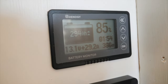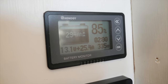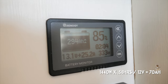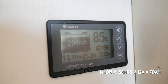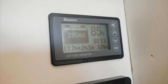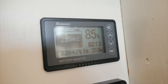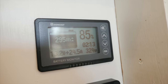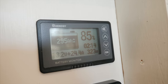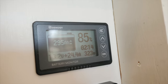The total elapsed time for the four-gallon Bosch hot water heater to fully heat was 35 minutes. Essentially that's 1,440 watts times 35 minutes — you can calculate the amp-hour usage for whatever batteries you have. The battery monitor also shows two hours and 13 minutes until the batteries reach 100%, continuing at 24.4 amps of charge. Of course that'll go down as the evening progresses, but we should have a full battery by sundown.